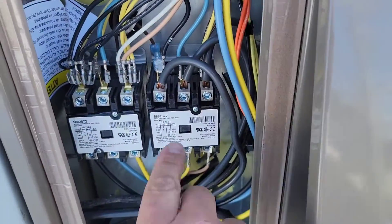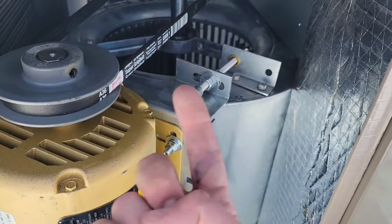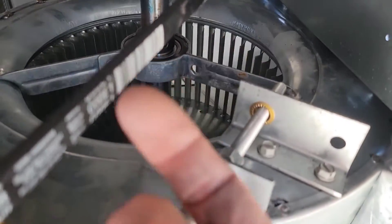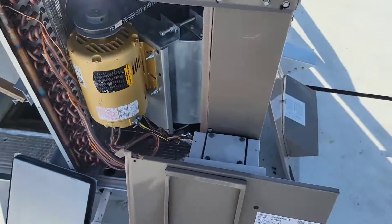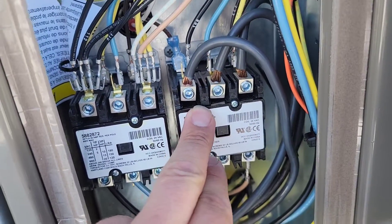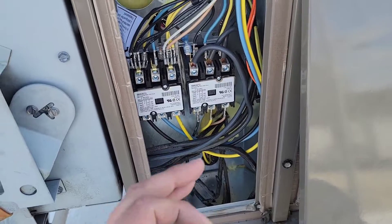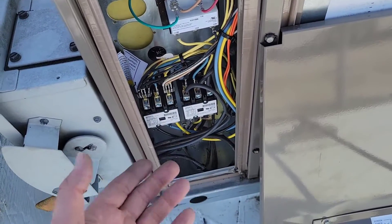This is 230-volt three-phase, which means we have three legs of power. On startup, you are going to check the direction of the fan. Usually there's an arrow on the unit and you'll be able to see that arrow and look at the wheel. In this particular wheel setup, it looks like it's going to turn counterclockwise. If it turns the wrong direction on startup, you're going to switch two of the legs — take an allen tool, loosen the screw on the contactor, and swap one of the two line voltage wires. I'll put a video in the description that talks about three-phase power and shows you how to switch it.